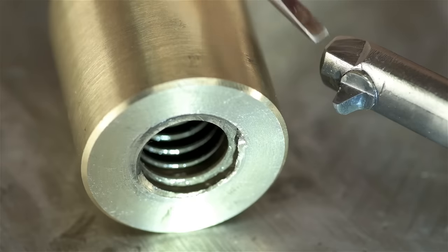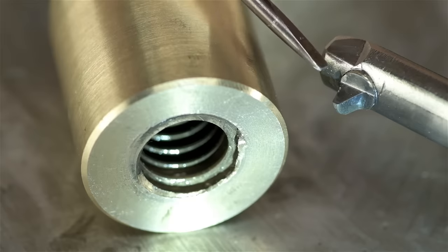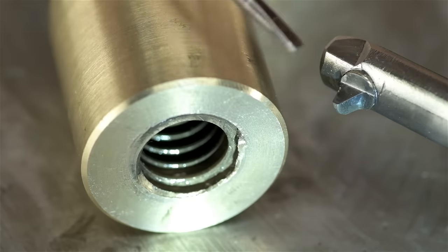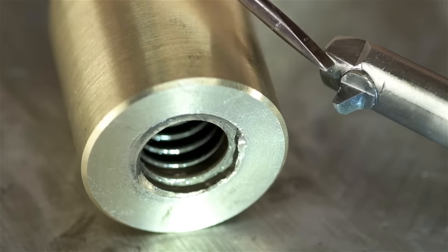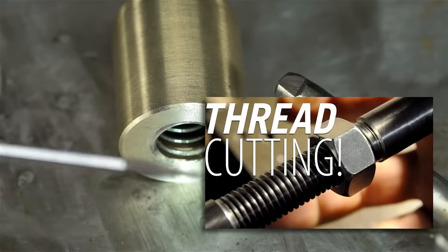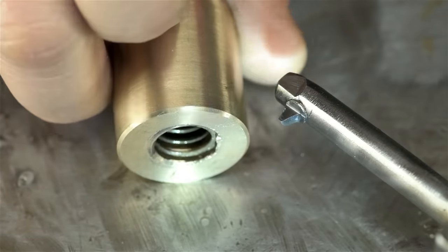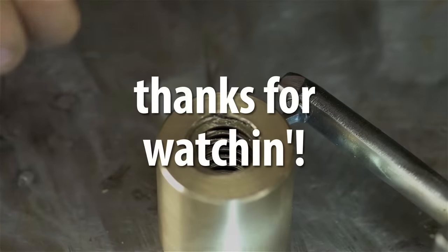The tool seems to have held up well. I did get a little bit of chatter down in the root, down in the bottom of the threads — perhaps it could have been a little bit sharper, or maybe I got some deflection. I think I ran this carbide too slow; I didn't want to touch the gearbox once the machine was set up for thread cutting. I skipped over some of the finer points of thread cutting, but if you go back to the actual thread cutting video, that's chock-full of details if you're into that sort of thing. Until next time, try to stay out of trouble, and thanks for watching.